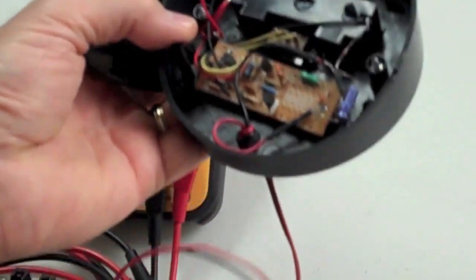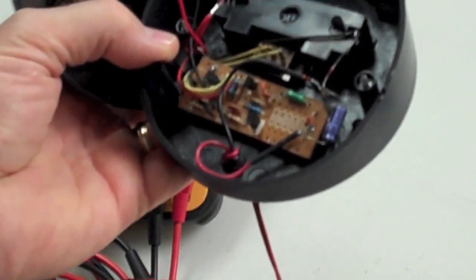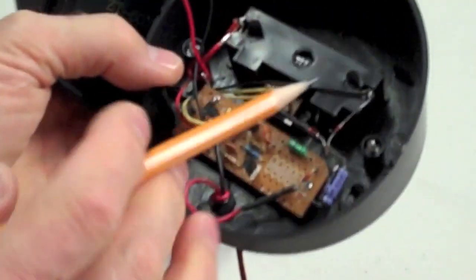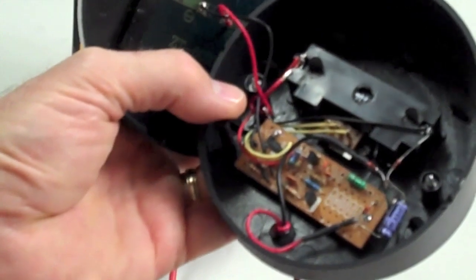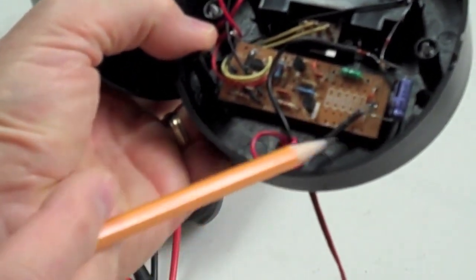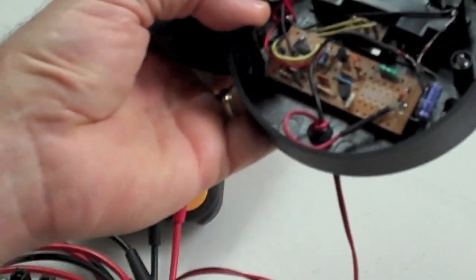It's real common, and the reason that I like those is because they're primarily meant for real low current applications, and the leakage on those is like 25 nanoamps. So if you've got a charge in this battery or a charge in a battery pack or whatever, they're not just going to drain through this thing with that low of leakage. So what I did is I put those in line to the wires here,